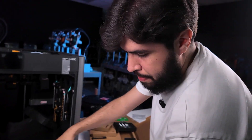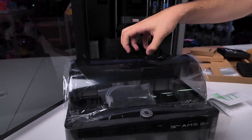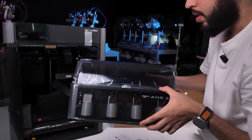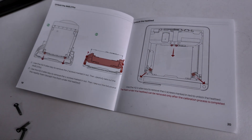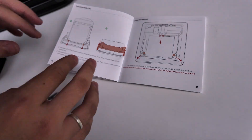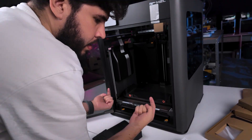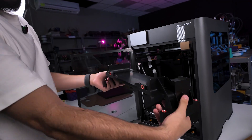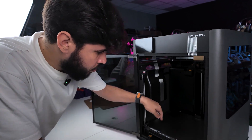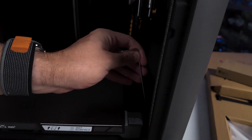Just remove the AMS. Now let's focus on finishing removing those, then later we start to assemble this one. In order to remove the bottom part that holds the AMS, you need to remove four screws. You are only able to see two on the front, but we have two more in the back. Now we can remove this plastic part. Now we need to remove the screws that hold the build plate down, so let's remove those in the front.